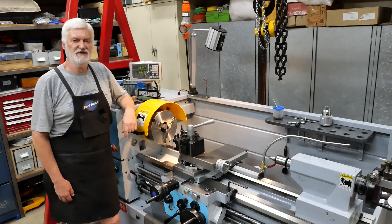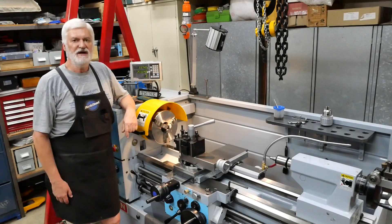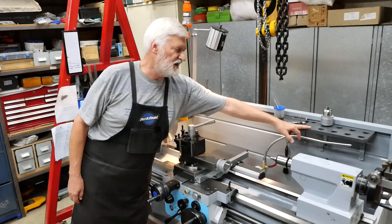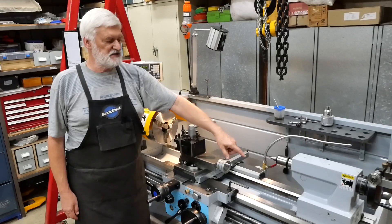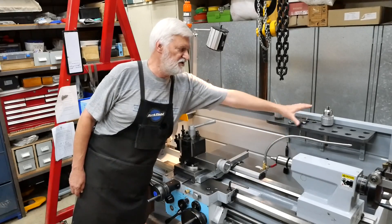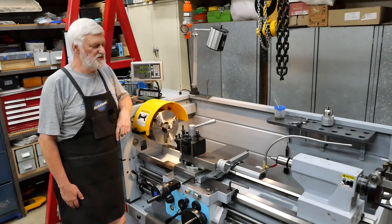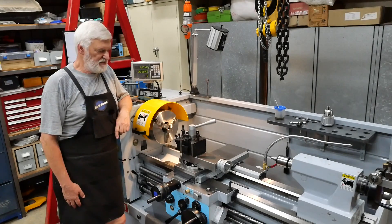I think that's finished it all. I've done the oil change in the headstock and the gearbox, sorted the tension in the drive belts, got the bed leveled again, and got the tailstock aligned with test cuts. I think we're good to go for another 12 months. One thing I noticed by accident: when I had weight on this shelf — all the tailstock components — my super-accurate spirit level could pick that up, making a fractional difference to the leveling. Going forwards I'll just keep the two things I use most there and make new homes for the other heavy items. It is a bit of a lever putting twist on the bed, and whilst it's a pretty stiff bed, there's no point giving it work it doesn't have to have. All done — hope you found that interesting, cheers.